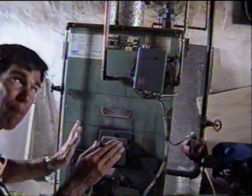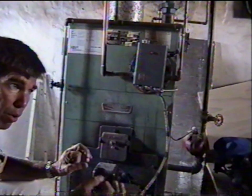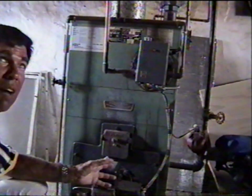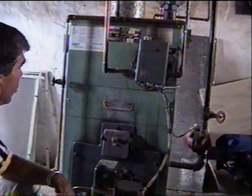And it goes into your burner motor. This shoots the oil at high pressure through a little tiny hole, so it comes out in a fine mist. And that's what burns. Right. Well, you're doing that for a period of one season, and that little tiny orifice gets bigger. Now you're dumping more oil in. Right. And if you don't change that in 4 or 5 years, man, you're just wasting oil. It gets sooty, you get a lot of debris in here. So it's a good idea to have it serviced. Okay.